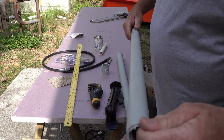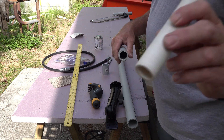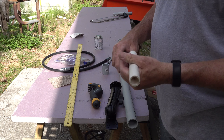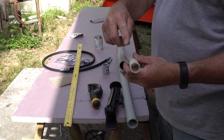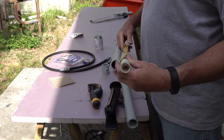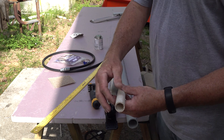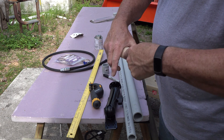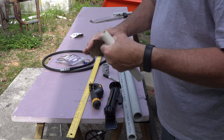I'm taking that little lip inside there down with sandpaper. I'm also going to sand this piece — the three-quarter inch — it's going to fit inside there. I'm going to sand that down quite a bit so that it'll slide in to give me a decent depth. I measure my transducer at about four or five inches, so as long as I have probably two and a half inches inside there, that should give me enough for my transducer to mount to the bottom of this. About three-quarter inch depth here. Using 40 grit — I just want to take off material pretty quickly.